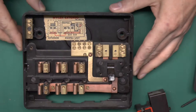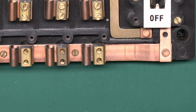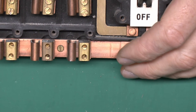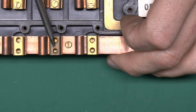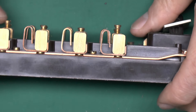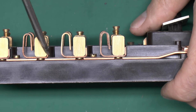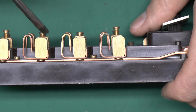Back on the other one — it's fairly similar in construction, the central piece essentially identical, and the switch and main bar are again pretty much the same. This one has the threaded holes in the bottom contacts, but of course you don't attach wiring there. However, the holes with threads do have a purpose — if you look carefully in the bottom, you can see the end of a brass screw in both of those holes. The reason that's there is simply to secure that brass block in position. You've got the brass busbar along the bottom, which is just one piece of copper; the curved contact piece is another piece; then the brass block in the centre; and the thing that holds it all together is two screws — one at the front and one behind — which screw into the bottom of the block to hold it in position.